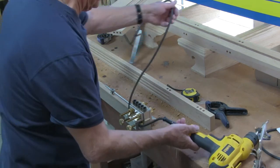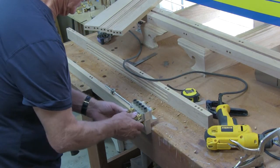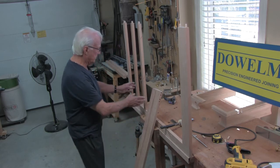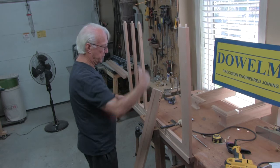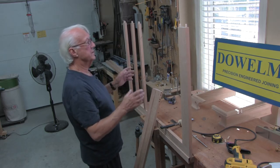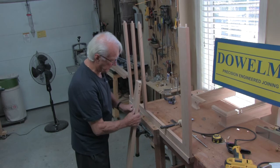That's all taken just a few minutes to do all these. That's the one inner vertical complete. Now we're ready to dry fit the arrangement. Obviously this is the top, these are the two intermediate rails, this is the bottom rail, this is the space for the two drawers, and this is the space for the two doors. Now, as I've said many times, when you're dry fitting, these dowels are snug — this is for strength. So when you're dry fitting, always just put about 50% or less in. Whatever you need to ensure alignment, that's all you need. So let's put this last piece together.